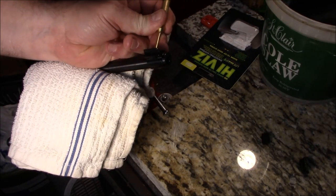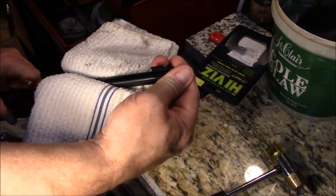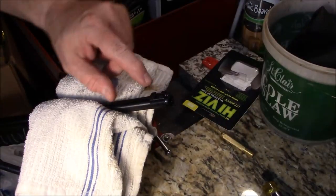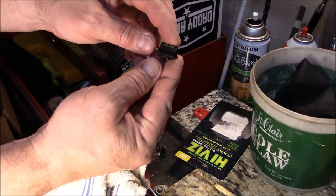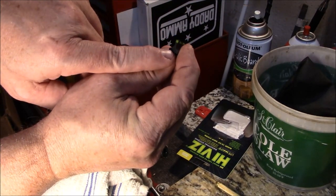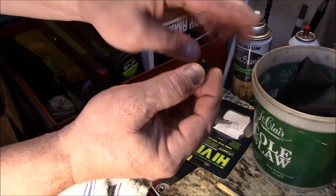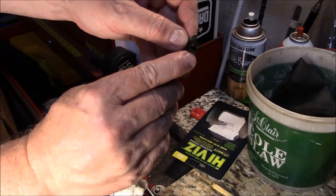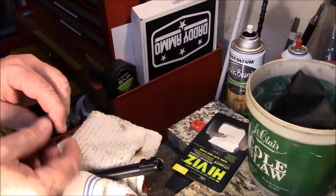The firearm came out of the vise just a little bit, but I think it'll be okay. What you don't want is this barrel bouncing back and forth a lot, which won't work as well. Clean up a little bit — if you want to put a little oil or something right there you can. Now this front sight, when you're installing it, pay attention because this one could be easy to get backwards. If you look, there are some grooves right here that cut down on glare — that obviously needs to go towards the rear of the firearm, towards where you would be sighting in. I've also beveled off the corners just a little bit on this one, because now we're going to go from this direction over that way to install.